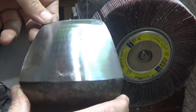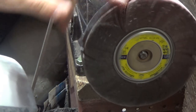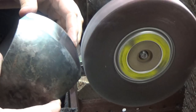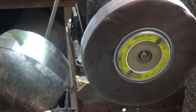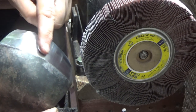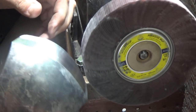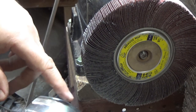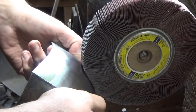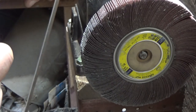You can see here already it's starting to change the look of it. Bear in mind with any of these discs - the direction they're spinning and the motion you work matters. If the disc is going that way and I apply the work rolling it that way, although it seems like an insignificant amount of force, it will have more of a polishing effect on the surface because I'm running with the disc. If you want to remove something particularly stubborn, on other metal work you can lean into it and pull it back towards you.